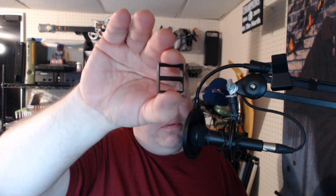There's the actual print. Thin walls, yeah, I know. That's why I use PLA Plus from ESUN. Black PLA. I did it at 215 with a 60 bed. And this thing came out nice and strong. Not strong this way because of the opening on the bottom there, and the top is a little bit weak. But not weak enough to hurt what I needed it for. And it's only 5 millimeters tall. So let's give this a shot. I printed it out — it took me about 18 minutes to get printed. And as you see, it goes on the antenna with no problem.